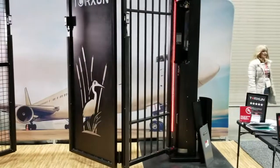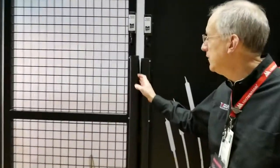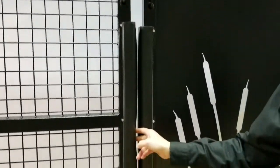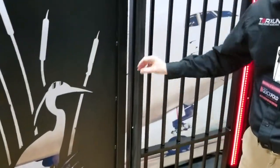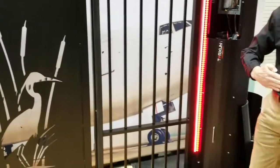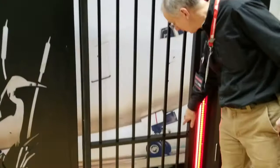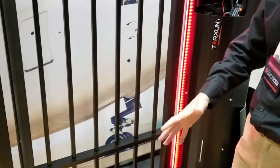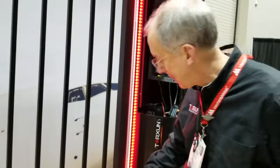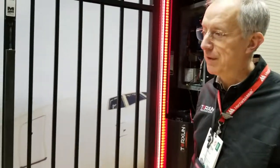For safety features, you've got miller edges wrapped around on the leading edge. And on the inside panel leading edge you have another miller edge which handles the gate as it comes into the entrapment zone. On the outside of the property there's a photo eye that goes across to protect vehicles or people who are walking through the gate opening while it's closing.